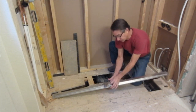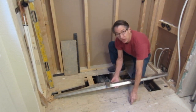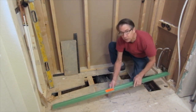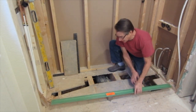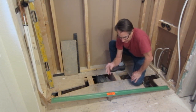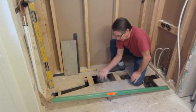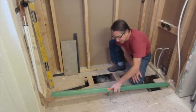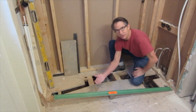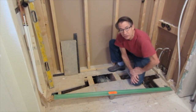This drain width is an inch and a quarter. I'm going to drill a hole for where the drain is coming through and cut myself a trough that's an inch and a half, which will give me just enough wiggle room and space. Because of this application, I'm going to have to attach the drain — I don't have access from underneath. So I'm going to attach the drain to all of my plumbing and make sure I've got a little wiggle room so I can lift it to get my sloping panels underneath and get my backer board underneath this flange from the other side as well.